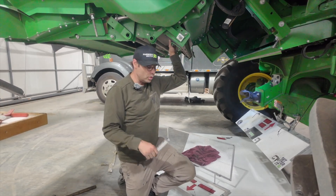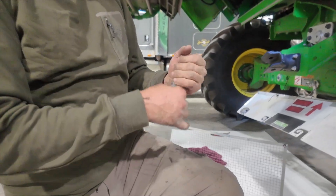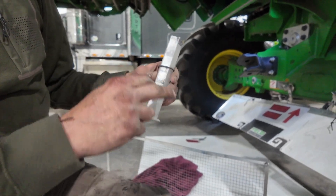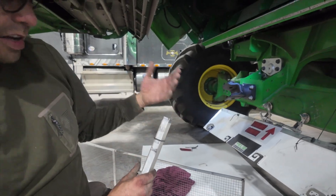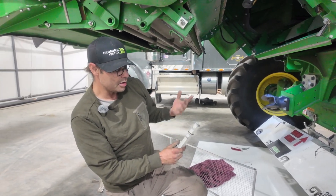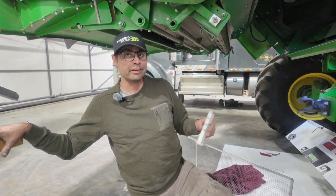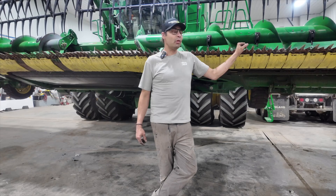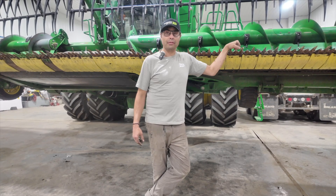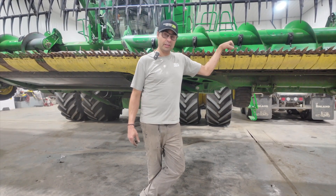You just dump in this and go. You do your first test and see your losses are here. You slide the indicator up to the level of the grain, then dump it out — it doesn't matter, you know where you were. Then you do your second test, make your adjustments to your combine, and let's say now we're down to that one bushel per acre. By the way, I count the first quarter bushel on any combine — nothing's going to really get it unless it's a special day. This is the first of many products. We also have another one involving a laser and the end of your sprayer boom — that's really cool. Resources are not endless but we've put quite a bit of time in on it and it's going to be awesome.